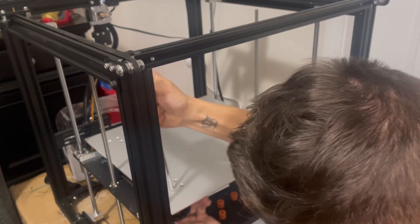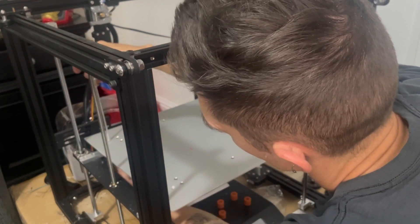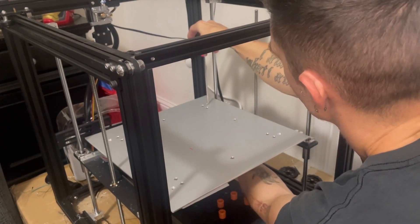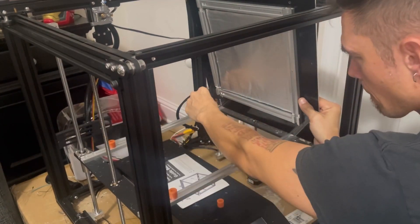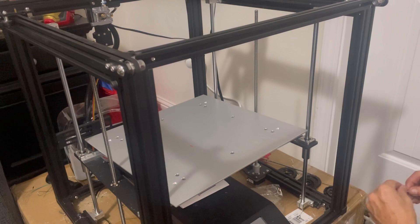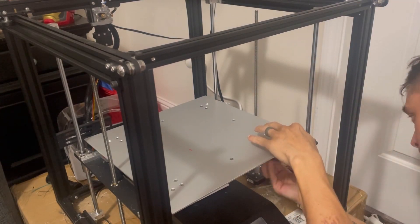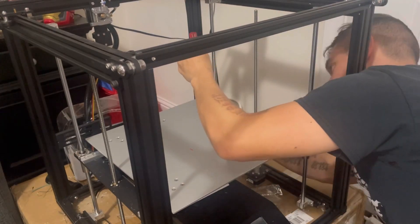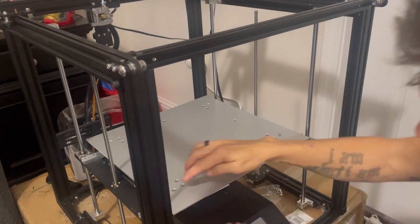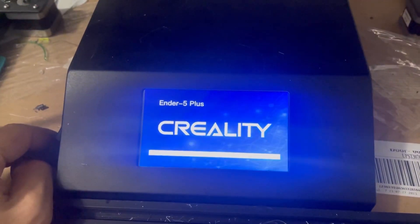The first thing you want to do is just drop your build plate to an adequate height. Then one by one, with the help of a screwdriver, remove the factory screws holding the factory springs and tightener knobs in place. Once you have all those off, gently put your build plate off to the side, remove the factory springs, and then one by one place the silicone bed mounts in place. Then just reverse what you just did — put those screws in place through the silicone bed mounts and get the knobs tightened just to hold the build plate in place. Raise the build plate up and tighten those a bit more. You can use the tip of your finger to hold the screw in place and get the adjuster knobs just snug.